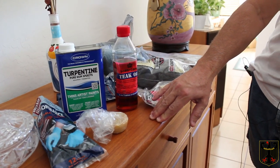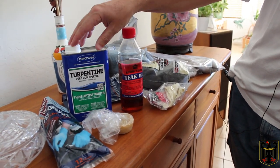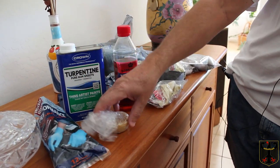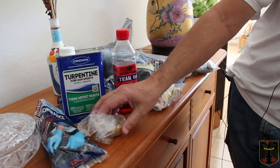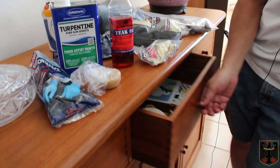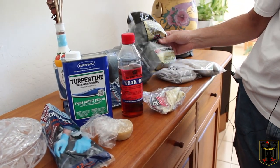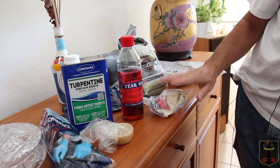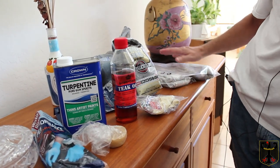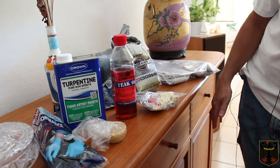To do it, I'm going to have the following items available: some turpentine, some gloves, some beeswax — and that's actually for the drawer slides. This has real wood slides on the drawers, not ball bearings, so you beeswax them. Some quadruple-ought steel wool, some tack cloth, and various cloths to wipe everything off and to put down along the base as you're cleaning.